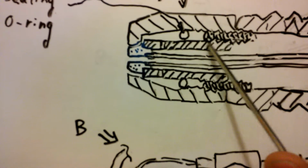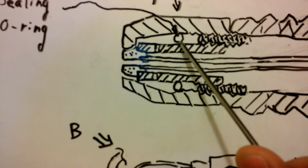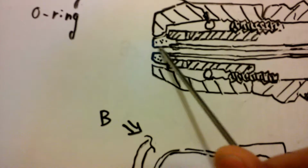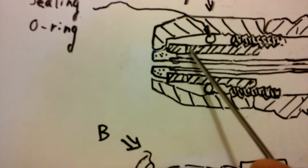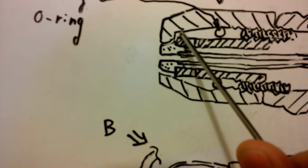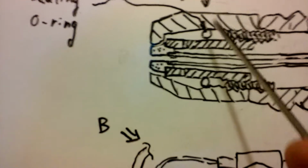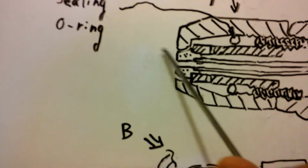And these 1, 2, 3, 4 are all fixed at a fixed position. And here is an O-ring here, because liquid is going out here, air is coming here and passes through this small hole here. There are 2 small holes here on the brass inner tube, and this air will go forward and prevent it from going backward and leaking out here. O-ring is put here, and there is a tiny gap here to let the compressed air go out.